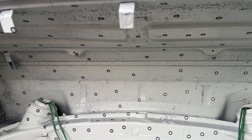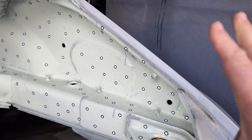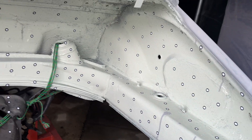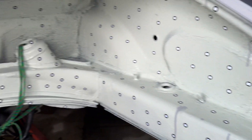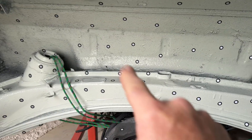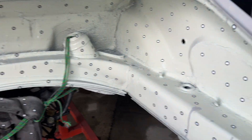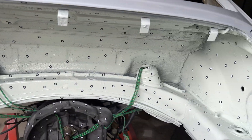Round two. I've pulled that little back pad, added a bunch more dots — a couple underneath and a few to the engine mount on each side. I'm going to divide this into chunks, because if something happens and I lose the scan, I don't want to redo the whole thing again. I'll do one from the outside, then get in and do the underside and try to connect the stuff together. The software recognizes the orientation of the dots and that's how it aligns itself.